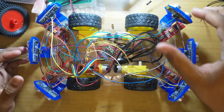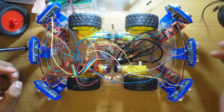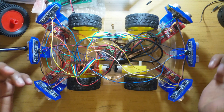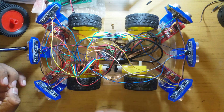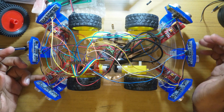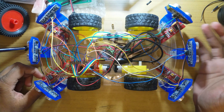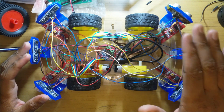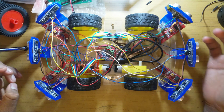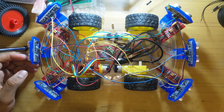There are two reasons I didn't use IR sensors for these front-facing sensors. First, IR sensors are pretty boolean in nature — they just give you one or zero instead of the actual distance. Second, IR sensors are not suitable for outdoor use because they don't work well with UV light; even a shadow or cloudy weather can affect them, and infrared from the sun is more than enough to knock them out. Ultrasonic sensors work better under tough conditions, though they can be affected by air density — if it's too hot or cold, the reading isn't perfectly accurate — but you can always set an offset when you program it.